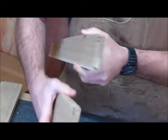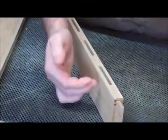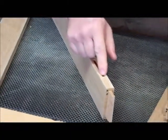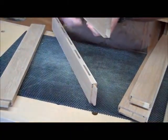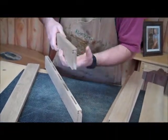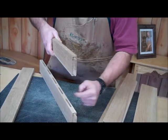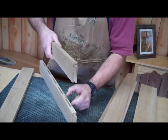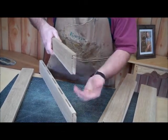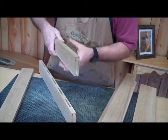The reason that's critical is because I use the same reference surface when cutting the mortises for the side slats. So I want to keep those reference surfaces in line with one another. That way, these mortises, even if they're offset a little bit, are guaranteed to be in line with one another so that my chair goes together square and tight and all my joints appear tight.